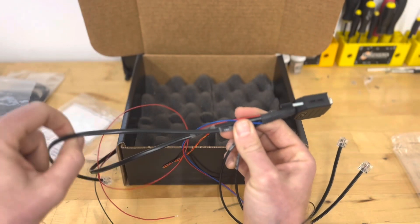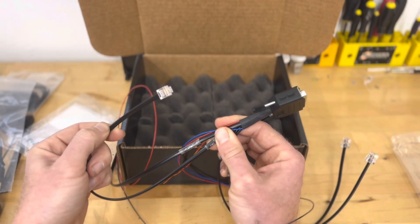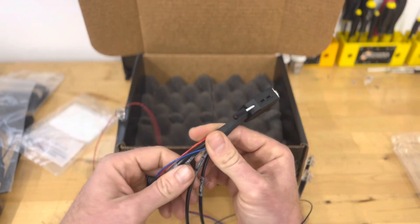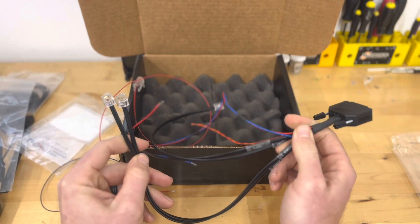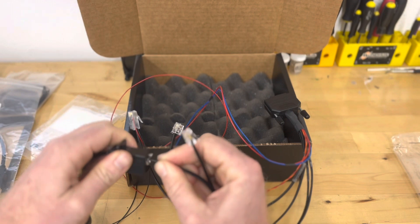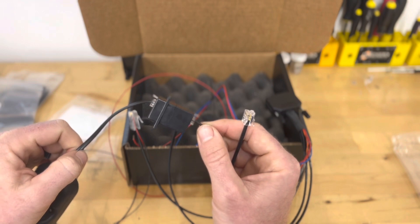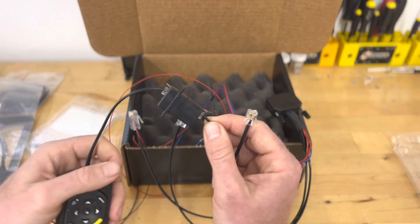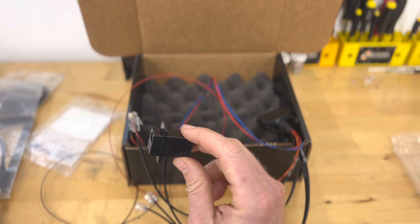The CNV is your serial cable that comes off to attach to your ClearNav variometer. It plugs into the AirData computer with the ClearNav variometer. If you don't have a ClearNav variometer in your glider, you can just leave that short. Then you have two remote posts. Those will plug into the other end of your 4-pin modular box to connect. You can either make that connection and leave it behind the panel if it is the stick grip remote, or if you're going to panel mount your secondary remote, you'll need a second modular box that we can send you if you have ordered two remotes. It does come with one remote, but if you want an additional remote, we can do that for you.